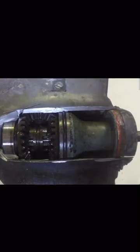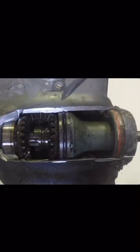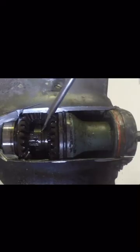Now if I push down on this gear selector, the gear selector pushes the dog clutch in to engage with this reverse gear. So what it means is the engine drives this pinion — or the bevel gear — which then in turn drives the reverse gear. The reverse gear is now linked to the dog clutch, and the dog clutch is splined onto the drive shaft. So now, as I turn it, we've got reverse.